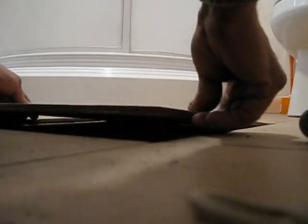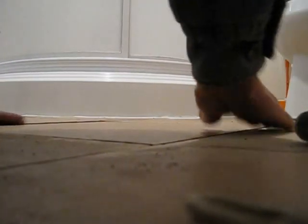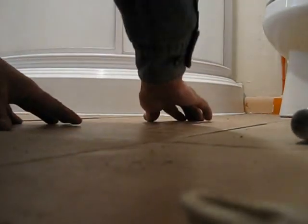Once your area is cleaned, vacuum it up and get all the little pebbles and stones out. Do a dry fit on the tile for two reasons: first, to confirm you're below grade of the existing tile, and second, to ensure there's no teeter and that you have a flush plane to apply the tile to. Then remove the tile again. Once the other tiles from this job are removed, I'll show you how to mortar it down and apply the tile so it's correctly inlaid into the bed.